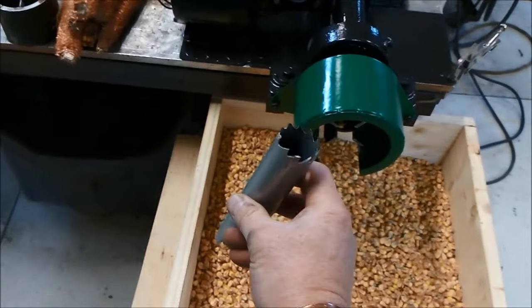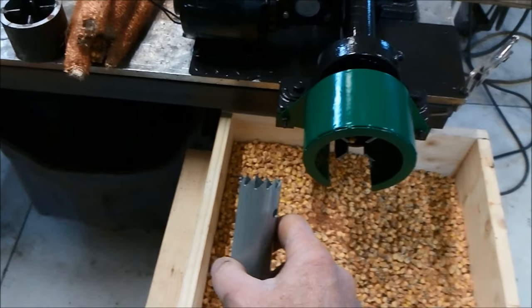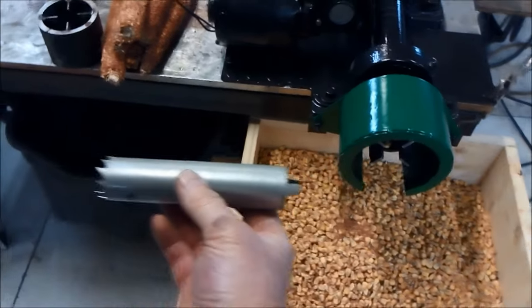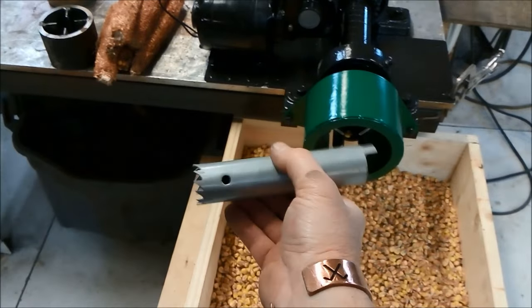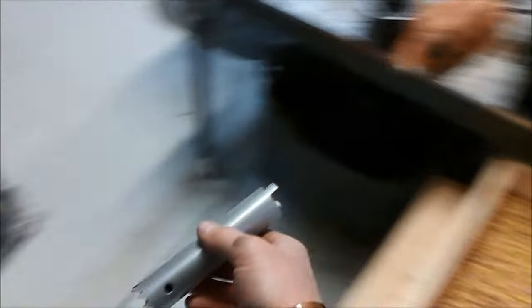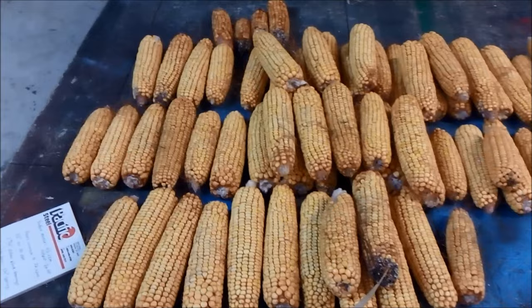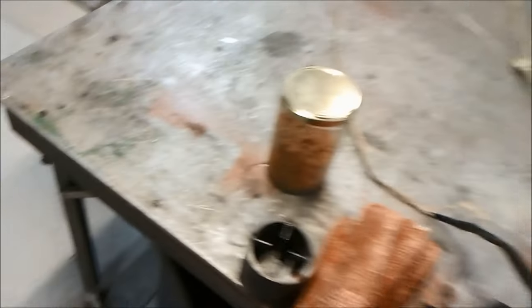All it is is a piece of inch and a quarter schedule 40 pipe or thin wall tubing. It can have a set of cutting teeth on one end — that worked okay — and then I put some cutter bars on the other end. You hold this and take the cob and either spin it by hand back and forth, or you can put a lag screw in a drill and run that into the center of the cob. What I found was some of this corn it works okay, but a lot of it the center of the cob was still a little too soft, so the lag screw wouldn't bite into it and it would just strip out, so you were left doing it all by hand.